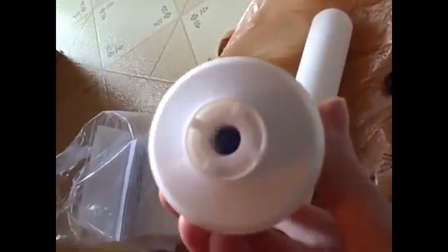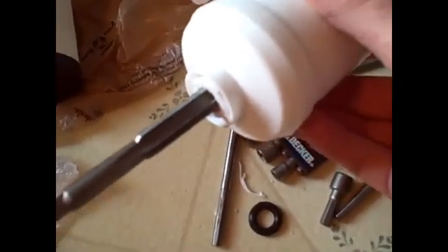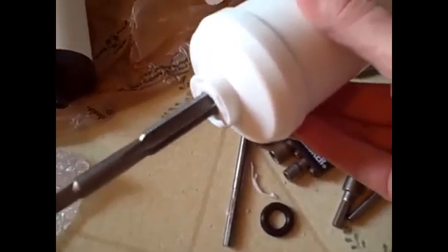I've drilled my guide hole using the 29/64ths bit. Now I come back with the half-inch tap and thread the holes. Hopefully these two pieces will fit together. Here I'm showing the tap inside as I bore it out — a key tip: back it out every so often to clear the plastic debris so it doesn't get caught in the tap. Continue threading all the way through.